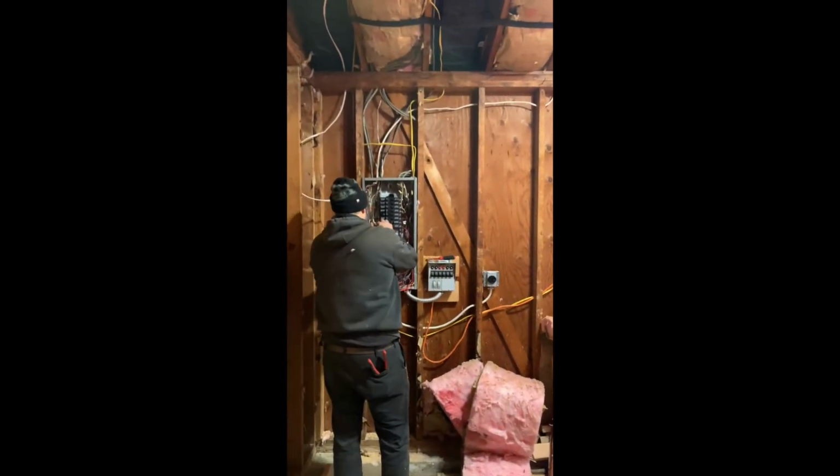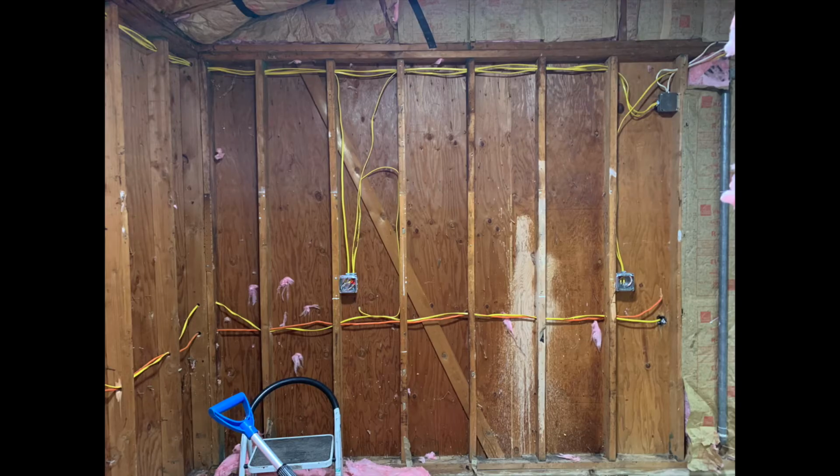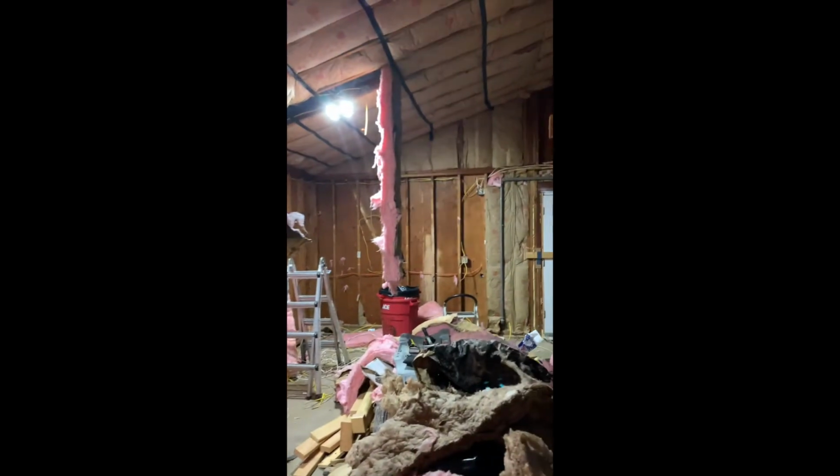If you look and you see the wires, obviously it's on a bad angle, but we had to take all those wires off the top and run them in the studs of the wall, so when they sheetrock it, the sheetrock goes flush against the studs and we didn't have to box anything out on the top.